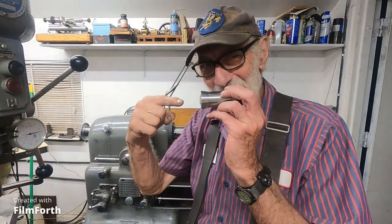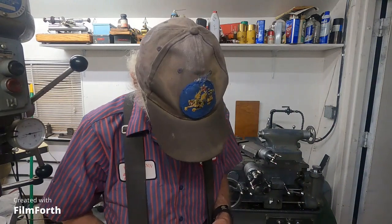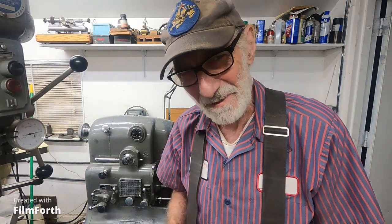The reason is they introduce a non-super-precision bearing way out on the left end of your spindle. And what happens? A little bit more vibration. If you've been following me, you know what vibration does - it makes parts bigger on the end. And the way I know these things is with more sensitive instruments, like the dial snap gauge, the dial bore gauges, and stuff like that. I call them the truth.